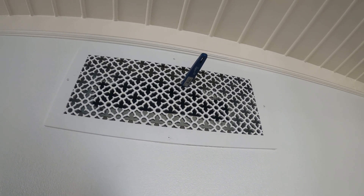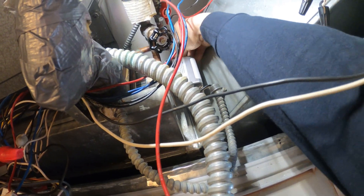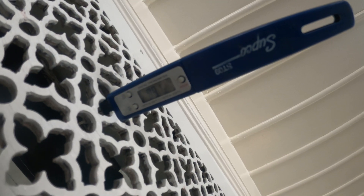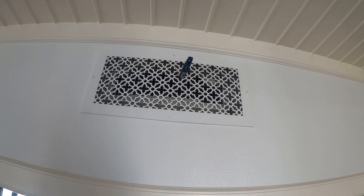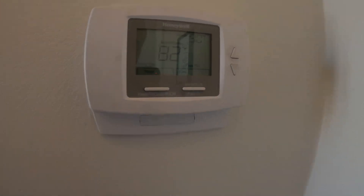All right, let's set it to heat and make sure the cooling doesn't come on as well. I'll give this a minute and see what happens. Putting my hand above here — looks like the stem for this actuator is closed, that's good. Let's make sure we're heating. We've got 89 degrees and climbing — nothing's missing, it finally works. Sheesh, people really shouldn't be touching these things.